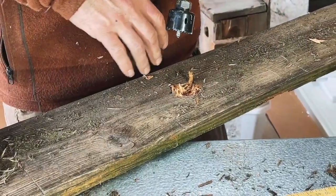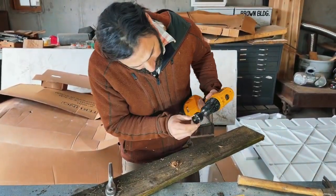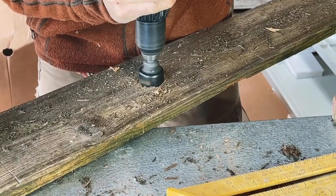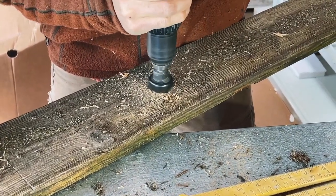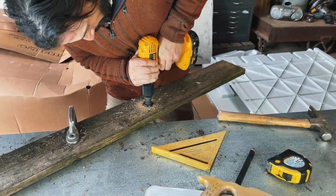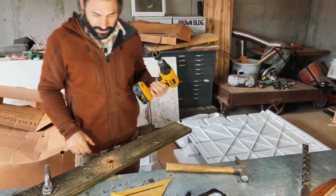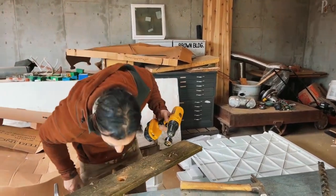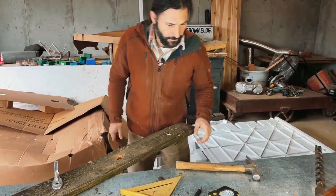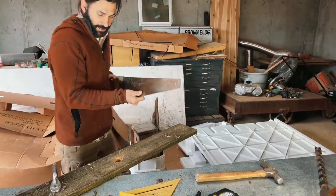Today this is just another example of an easier way to make a hole. I like the old ways, but I'm trying to make a video so anybody can make a birdhouse with the tools they have. You might have one of these — a little drill with a hole saw, this one is inch and a half as well. Not as fun as an auger, but it did the trick. Now I can get on to cutting. If you have electricity and a chop saw you can make these cuts super fast, but we'll just do it with a handsaw.